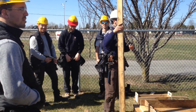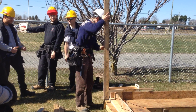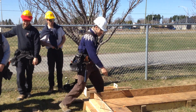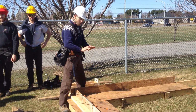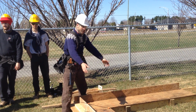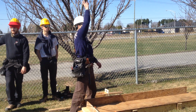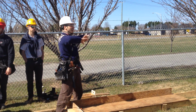Would you set rebar on that? You're videotaping? Hold on. Your question is, are we going to put rebar on there? In here, there would be dowels coming out of the footing, and that would be it. There would be little dowels coming out like this. You would build the outside wall. Once the outside wall looks like that, the steel workers would come and connect the dowels to longer rods, and then do a horizontal mat where they could climb on it and fill it with steel.